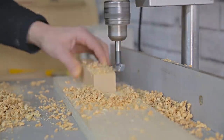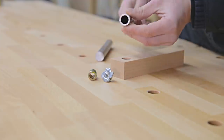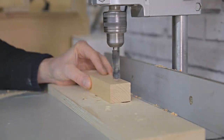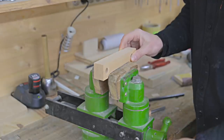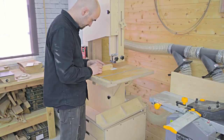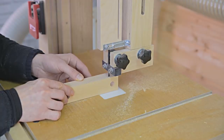I'll use a steel rod, though a steel pipe with the same diameter and a 3mm wall could be used instead. Now I'll drill the holes for the threaded insert — here we could also use a T-nut. Then I mark the outline of the pieces so that I can cut them with a bandsaw, and sand all their sides with a disc sander.